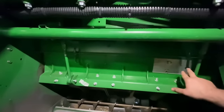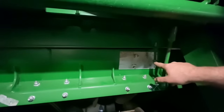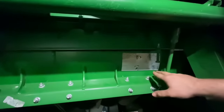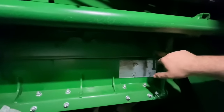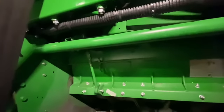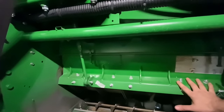If your threshing clearance isn't mechanically zeroed, you could be too wide. Say you're in corn and you want to be on 30 — you could actually be at 45 and not even know it, even though it says 30 in the cab. The concave raises up until it touches this bolt here — these are your stops. I'm not going to go through the full leveling procedure in this video, but the procedure is in the owner's manual.